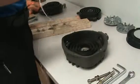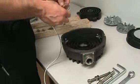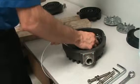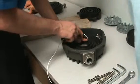You will have to cut the tip seals, if you saw in the box. Do you leave a little bit of space, because it'll expand a little bit as it gets worked in? No, I just go right to the edge. If you notice, there's teeth right here that lock the tip seal in place in the high pressure chamber.